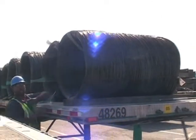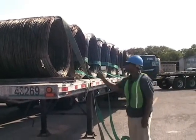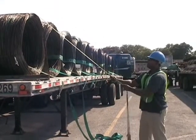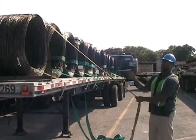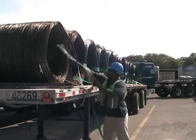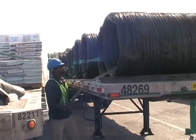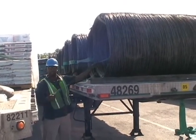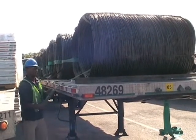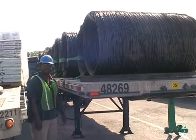See that? That's perfect — that's what I want. As you can see, I've thrown the strap over the top. Now I'm going to pull all the slack out of it and keep it as center as I possibly can, and then we're going to throw it right back through the coil again so it'll be on the other side where we'll hook it. Throwing it through. This is the last procedure of butterflying. We've got the hook on this side, it's went over the top, and it came through the center again. Now we're going to hook it. Everything is straight. Now we're going back to the other side to tighten it up.